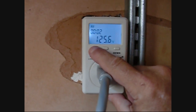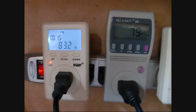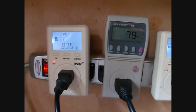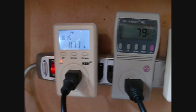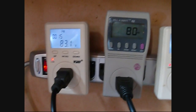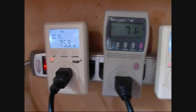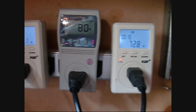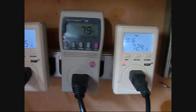Getting back to the power reading - 234 watts is what I'm reading for the accumulation of these three panels. You can see my two monos are within a few percent of each other. Must have one that's either not producing as much or might be a little bit more dirty than the other one. It's a very hot day here today - I did go out and spray them down with water earlier and it actually increased the power by about 15%. Looking at the polycrystalline one on the right: 73 watts versus 83 watts - it's clearly not doing as good as the monos on the left.